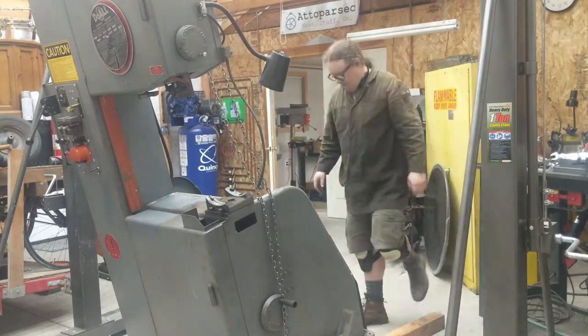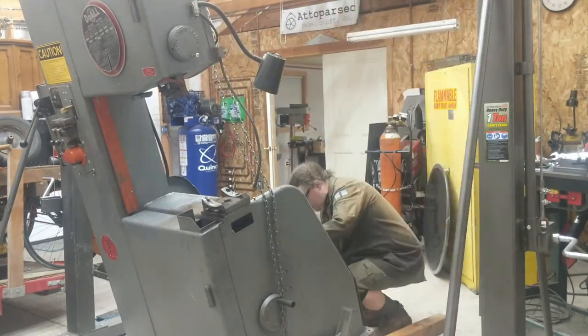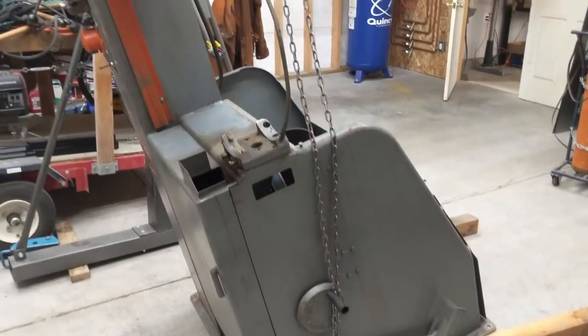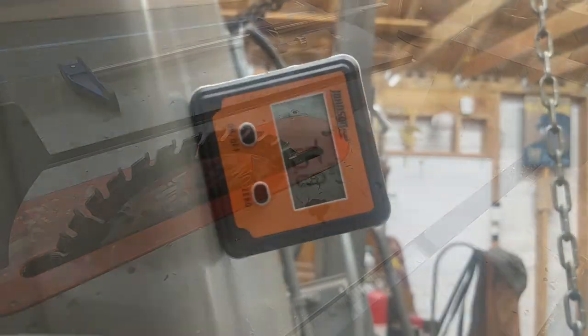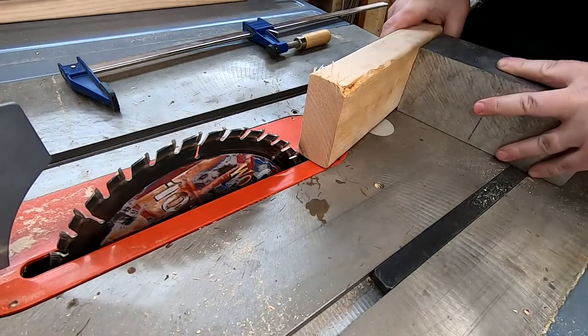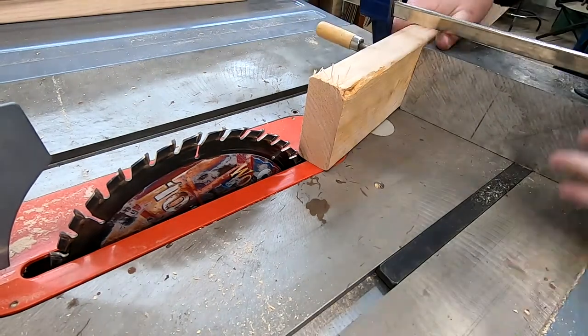So I removed as much weight as possible, and tested it hooked to the gantry crane, making sure there was never much slack in the chain hoist. And it worked! At 15 degrees, I could give it a full body shove, and it didn't begin to tip over. So I guessed I had no choice but to try. First I made some custom skids to go under the saw, made out of 2x4s. These would be screwed and clamped in place, to keep the saw in tippy toes for the operation. They needed a 15-degree bevel.